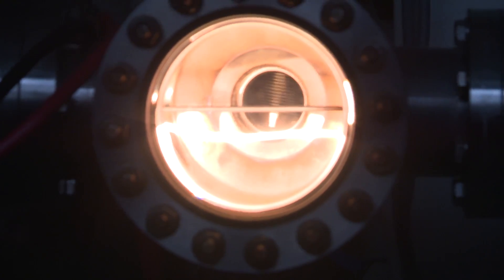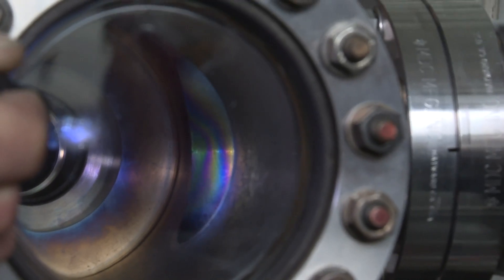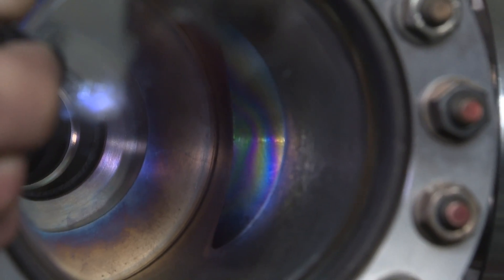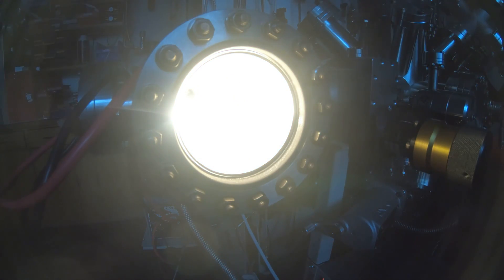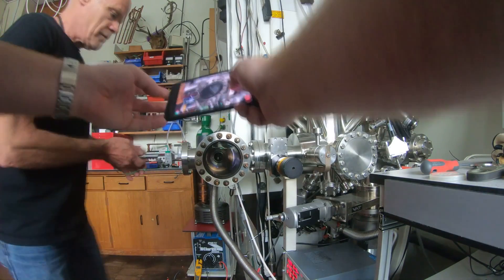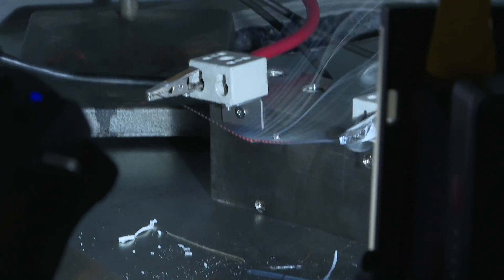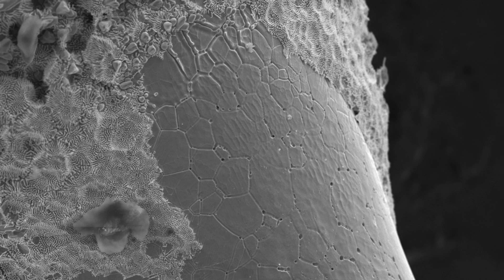So just heating it up drove off whatever muck there was on the surface, and left a really nice, clean piece of molybdenum wire. Also, when Neil opened the chamber, there was clearly a very thin film that had evaporated, and you could tell it was thin, because it had a rainbow of colours. You get these colours by diffraction of light by very thin films. Because it went to such a high temperature, the molybdenum was evaporating — it didn't have to boil because the pressure was lower — but some of the molybdenum vapour was coming off, and it hit the cold surface and condensed. The important message is that this experiment, which began really as a fun experiment with a piece of molybdenum, has not only made us think and understand something about heating wires in air that we hadn't really thought about before, but it has given us these amazing pictures. And my favourite one is free to download in the description below.